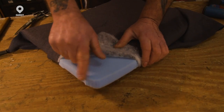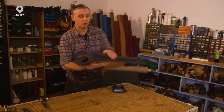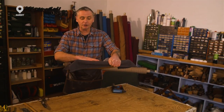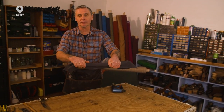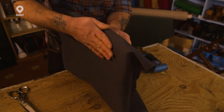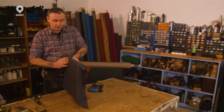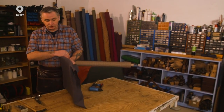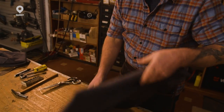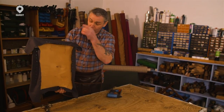You may have noticed when I cut the foam it's only got a square edge on it — it's not rounded on the top. And you can see on the edge here what it's like once it's upholstered: you've got that nice rounded edge. All you're doing is relying on the fabric to pull that into shape. Just pull it out towards the corners, nice and smooth, and repeat this on all four sides. That's all the sides done now, so all four sides stapled to within a couple of inches of the corner.